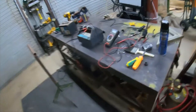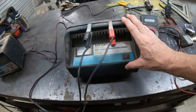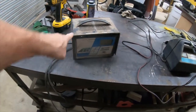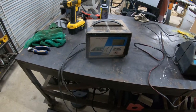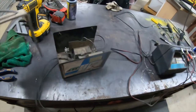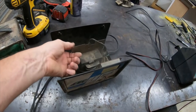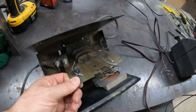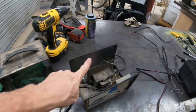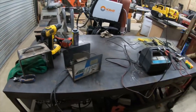But if you're cleaning big iron, you're going to need some amperage. If you've tried to use these automatic battery chargers, you know they do not work for electrolysis. You have to use an old manual charger, and these things are getting harder and harder to find. I've had this one for literally 20 years and it finally bit the dust — the windings in the transformer finally burned up. It burnt the diodes, and I replaced the diodes, but we're not getting 12 volts AC out of the transformer, so it's fried.